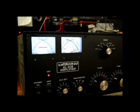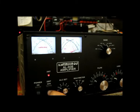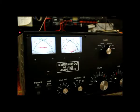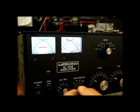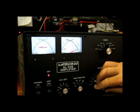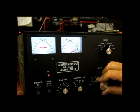All I would have to do is go over to single sideband or whatever mode, set the power to whatever I want with the exciter, and run the amplifier. But let's look at how easy this is to change bands with this module in here. I'm going to put it on 20 meters. I'm going to change the exciter to 20 meters, and now without re-tuning it from 40, I'm just going to turn it right on. Then again I peak the plate, and there we go — this just happened to wind up okay.